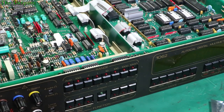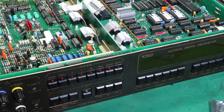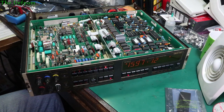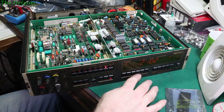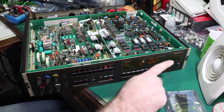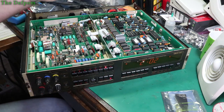I was getting an error on here apparently to do with four-wire being turned on into a test, so I'm going to put it under two-wire. We're ready to go. Power's on at 214 volts - should be high enough. Let's do a test. Volts and ohms both passed. AC fails calibration - so volts, ohms, and AC. Three functions didn't report errors but calibration failed. I know that because there's no battery, there's no calibration data. Hey, this is looking good.